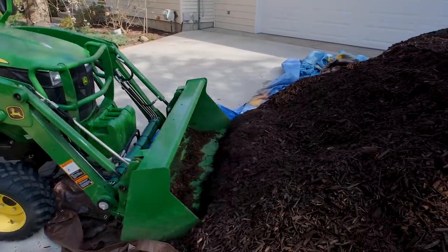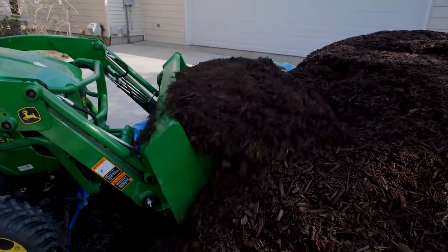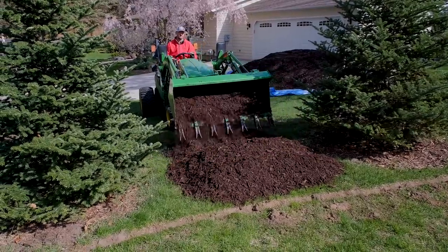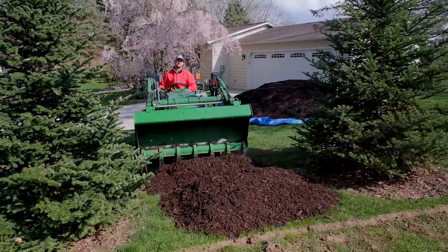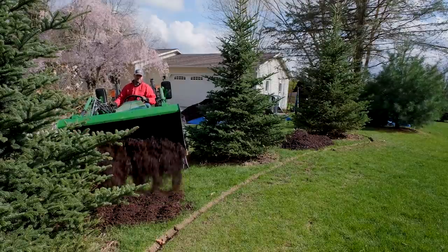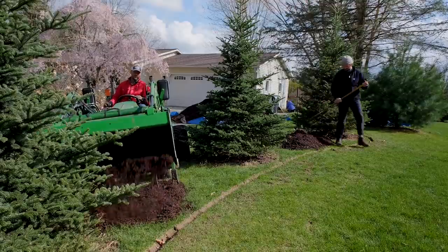These 70 pound weights are going to be a little bit cheaper on a cost per pound basis, and you can hold, oh, what was it, 700-800 pounds total is what the 3-point is going to lift up. So you can pretty much max it out with the combination of the quick hitch, the weight bracket, and the 8 70 pounders. You're going to be right in that ballpark and max out what you need to without adding any more weight.